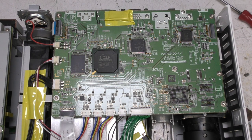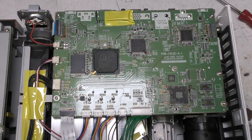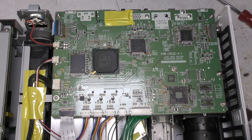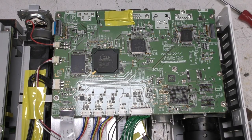At the bottom there are some unpopulated areas connected to an unpopulated USB and Ethernet connector — that's for versions that have onboard networking and things like being able to play Excel spreadsheets standalone. The chip on the right is just a general-purpose processor that handles all the user interface and other low-level stuff.